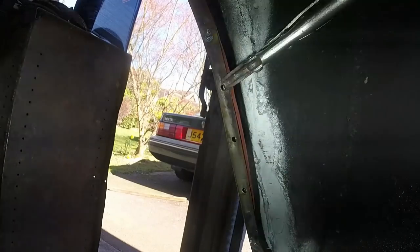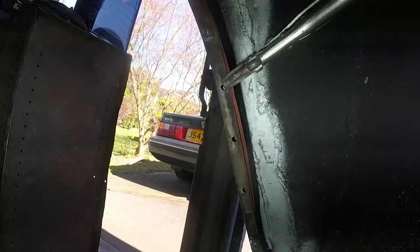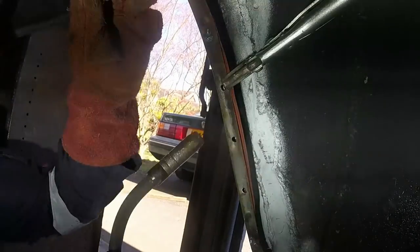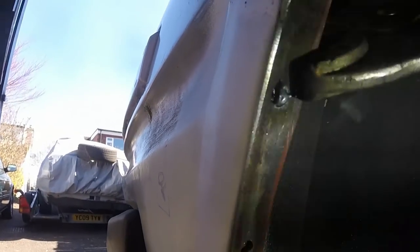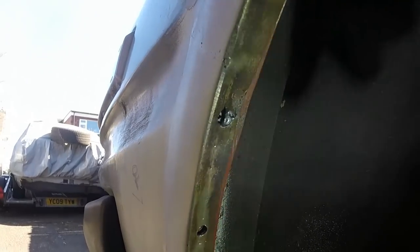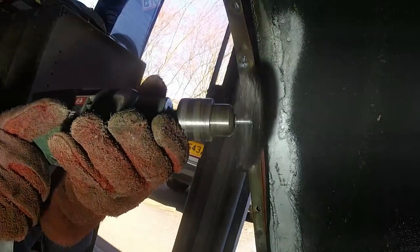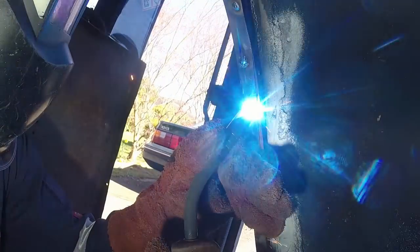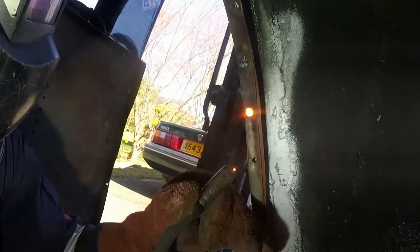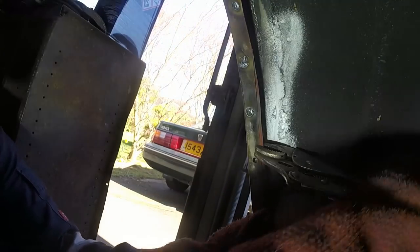Ooh. So, I'm just going to turn the welder right down. Actually on 1 min now, so lowest setting. So that, one big heavy tack, but I know that those panels are now going to be joined together. Now I can just clean it off and fill it up. Nearly there, two more to go. There's a bit of cleaning.